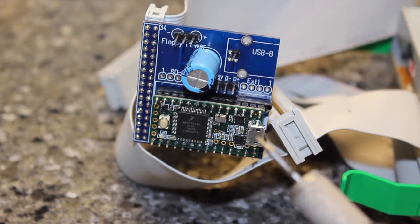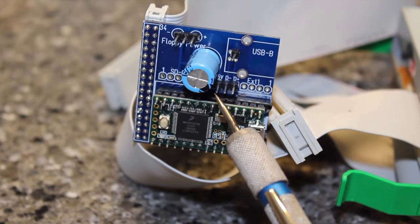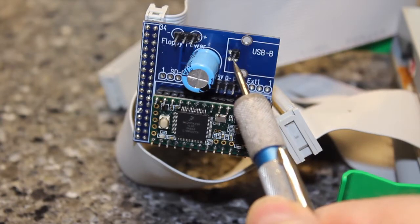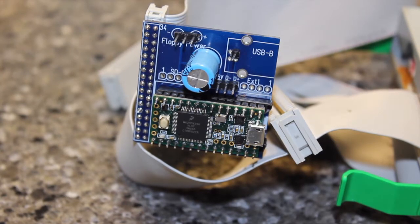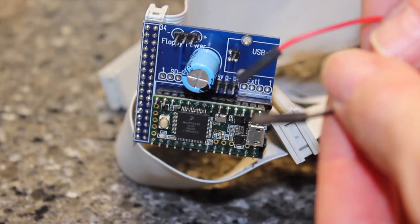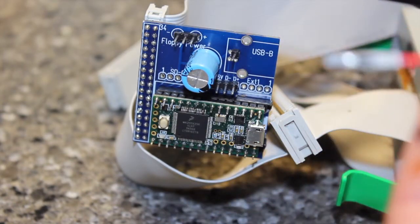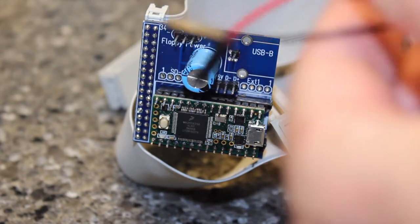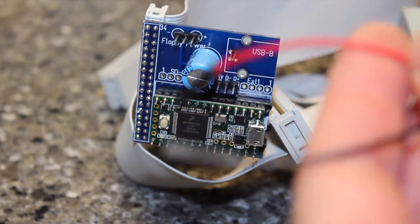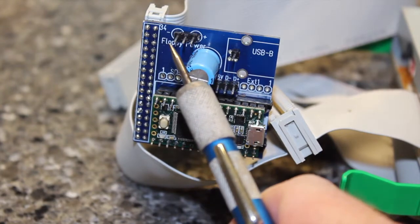One of these pins here is plus 5V, and the ground point is here, so you can use that for ground. You can cut and make your own floppy cable or your own power cable if you want to power this via USB. What I've done is taken Arduino wires that I cut off and in a very ugly fashion put those on a USB cable I had lying around. You can search for the pinouts for what is plus 5 and minus 5 on USB. I made one red for positive 5 and one black for minus 5, so you can power it that way.